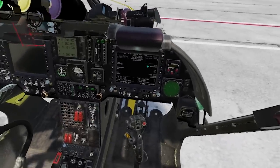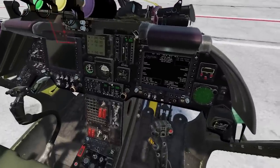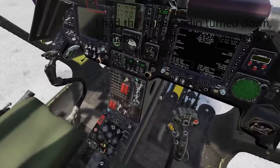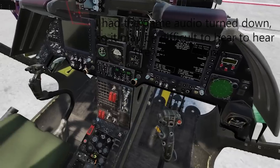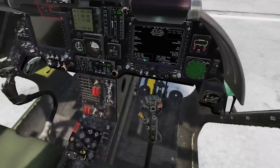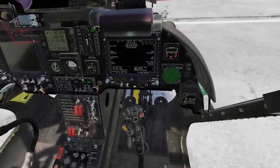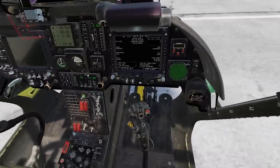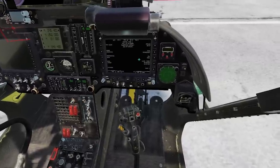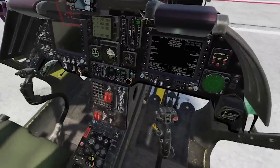You hear the little click as the battery relays close. In about 15 seconds the audio system runs through a built-in test — we're going to hear the low rotor audio. I'll act that off with my acknowledge switch. There's the audio — one click of the acknowledge switch to act off the audio. My remaining cautions and warnings stay on screen. I have 13 cautions and three advisories; I can page through each one with additional presses of the ACK switch until I get to the last page, which acknowledges all of them.